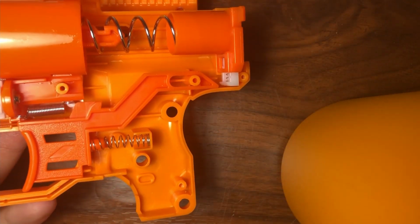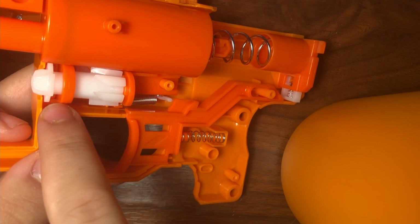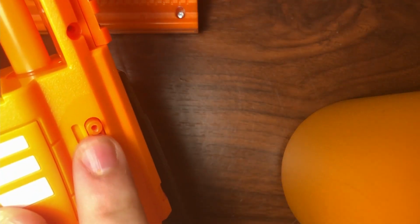Now, with all the locks removed, the lock here, and the one in the slide, and the spring underneath this piece, the little wedge down there, upgraded. I'm now going to reassemble this. Before putting all of your shell screws in, you can put on your top slide, but without screws. So you can just kind of hold it in place, make sure that the notches here and on the other side are aligned with these holes right here, and that this pin is going into this post.